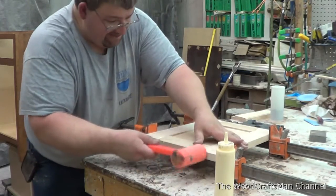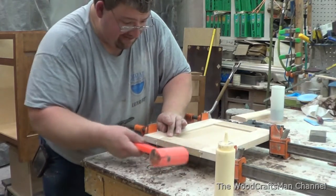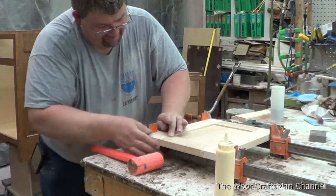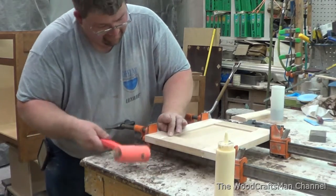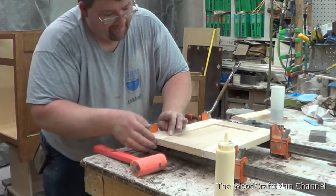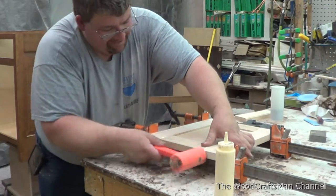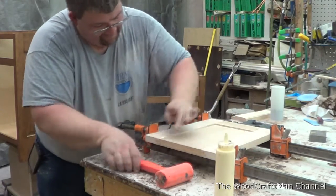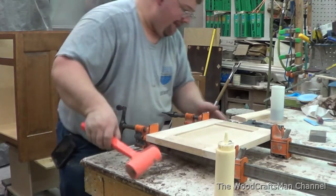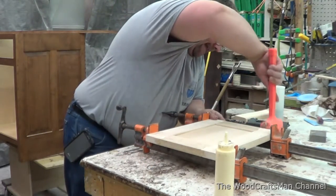They'll pull up the drawing, make the changes, assign a new part number, and send me the tips. Now, somebody might still argue and say I need to brush it. Well, that's their own personal opinion, and this is my personal opinion. I've never yet had a door fail in the field in the 20 plus years I've been doing this. I've had other failures in the past due to neglect, but not a door joint. So if you want to brush it, you can, but it really depends on how nice your joint is cut. So please, take this comment for what it's worth.